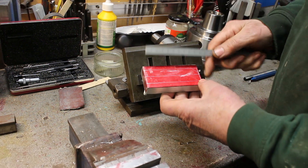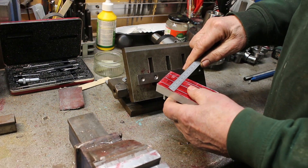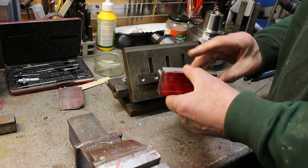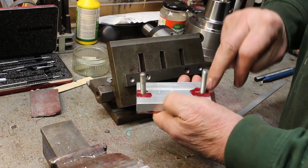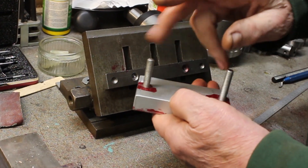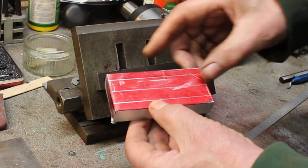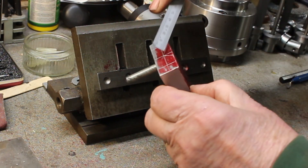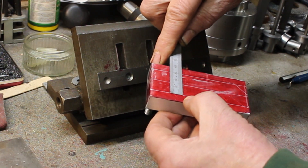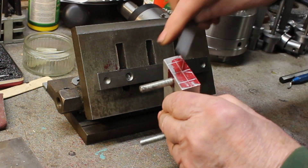It's about 100 millimeters long, 20 millimeters thick, 50 millimeters wide. I've squared this up on the shaping machine and drilled and tapped two blind holes for these two studs so I could bolt this to an angle plate from behind. I've marked out the centre line — I'm going to put a V-groove in here, 30 millimeters wide, so this will represent the angle of the drill point.